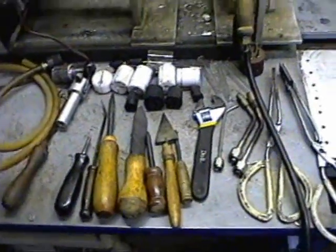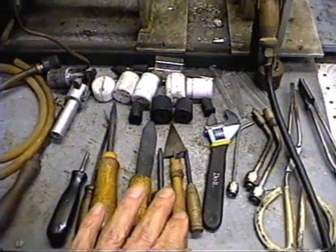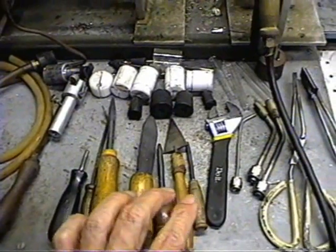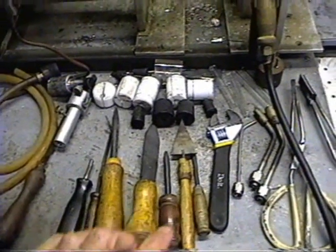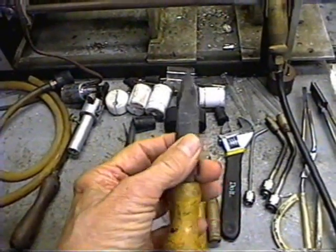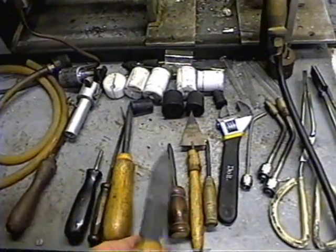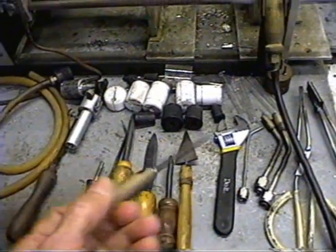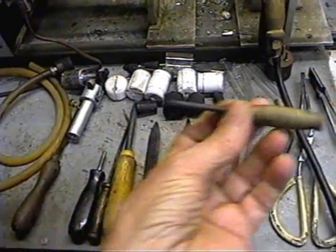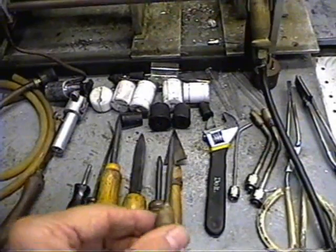To work the glass itself we use tools made either of carbon or stainless steel. Steel is not used very much because molten glass tends to stick to steel. However there are certain shapes you can't make out of carbon because it would be too fragile. Most of the tools we use are carbon. This is simply a piece of carbon from an old dry cell, ground to a point, used for making flares. This one was made from a flashlight battery carbon and is used for general purpose work — spreading glass, manipulating, pinching, pushing.